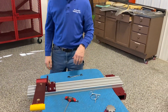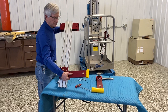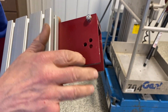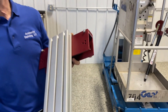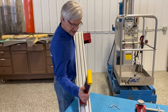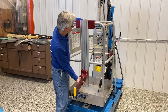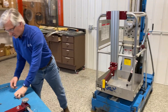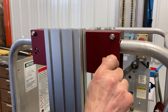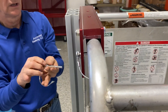At this point, we're ready to put it on our man-lift. Most man-lifts have an inch and a quarter rail, but we give you an inch and a quarter, an inch and five-sixteenths, an inch and three-eighths, or an inch and a half — so there's plenty of adjustment there. This particular lift is going to have the second position used, so I'm going to put that on there. I'm going to put this out so it stays balanced when I put it on. Two clevis pins go in. I know that if I put it in this hole it's too tight, so I go the next hole down, bring the clevis over to the side, and put it on — same thing here.